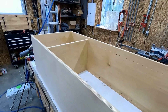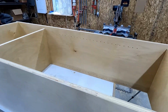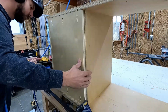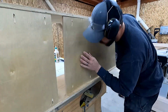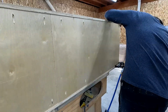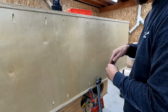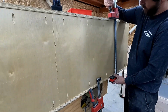All right, we got the cabinet assembled this far. We got the shelf pins in. Just got the back panel left to install here. That's what we'll be doing first. So my inset is perfect along here, very consistent. I could drive the pocket holes in, but it's gonna shift in, I know it. So what I'm gonna do is run 2 clamps here near my center pocket holes.